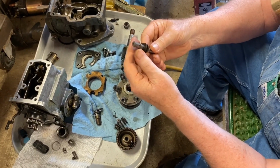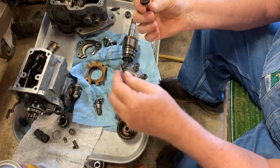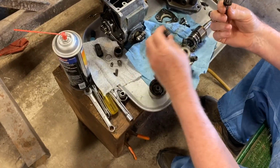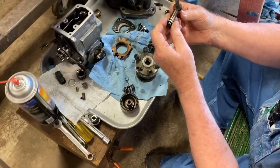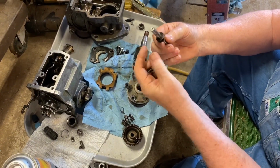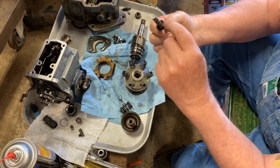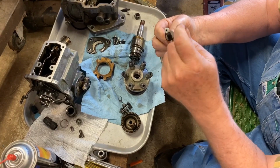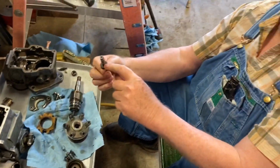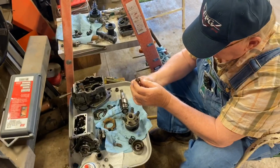When you shut the engine off, you pull back, the rod comes back. Put this back up here again. The rod comes back and turns in this direction. It pushes this down. It can't compress fuel up here because this is open and the fuel goes right back down through this hole and out right here. So that's why it stops when you shut it off, when this drops.